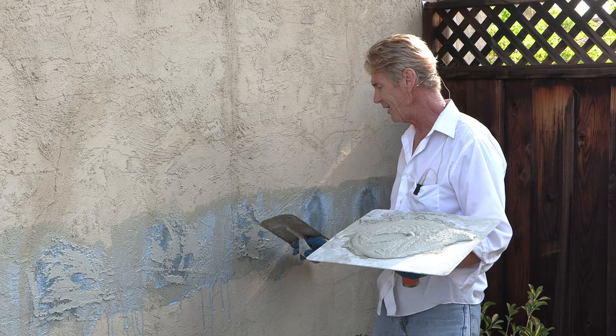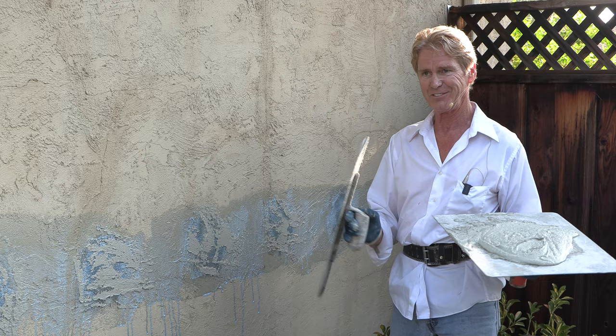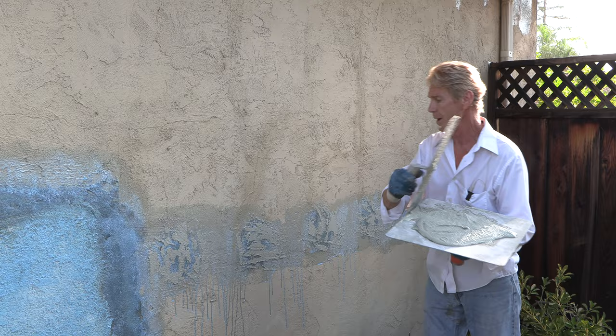The wall was crooked, like some of these holes, and he looked at it and said, you're learning bro, but let me show you how to fix it. And that's exactly what I'm showing here — where if you go straight up and it leaves these hollow spots, just put a little bit on the tip of your trowel. It doesn't matter if you're using a pole trowel like the 20-inch I've got, or a square trowel — that doesn't matter.